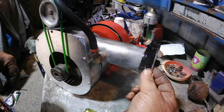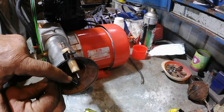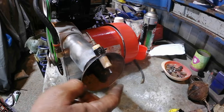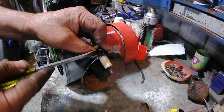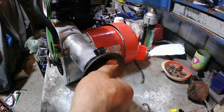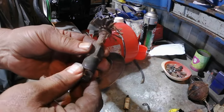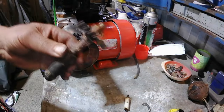Okay, here's our sparker electrode. I'm going to fit it there like that, so the spark will leap across there. That should be good. Okay, before we do that, we're going to take out the nozzle. This is the fuel delivery nozzle. So I guess it's a bit like a diesel injector nozzle, although probably low pressure. I've already loosened it. We're going to take it out and clean it. So it has a little wind turbine here to get the air really turning, and then the fuel is sprayed out into it. So let's take this apart and give it a good clean.